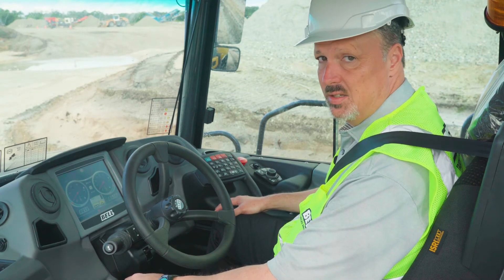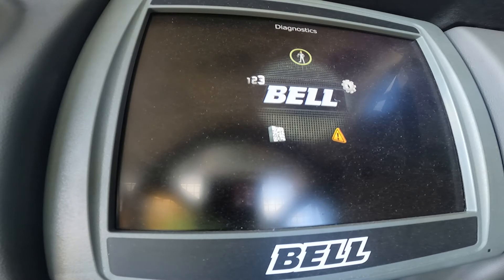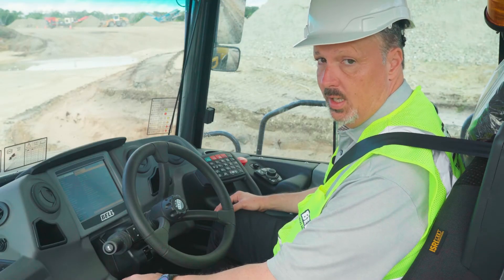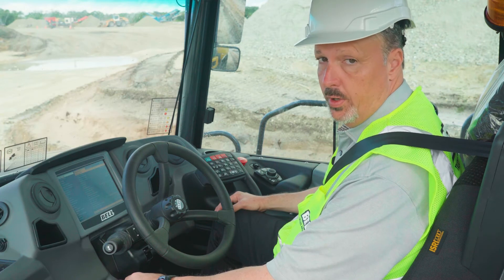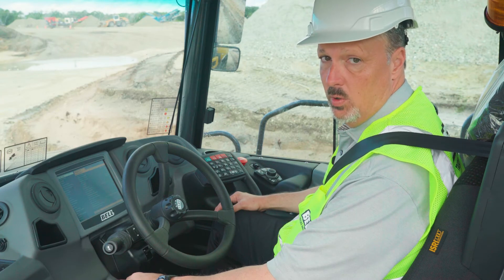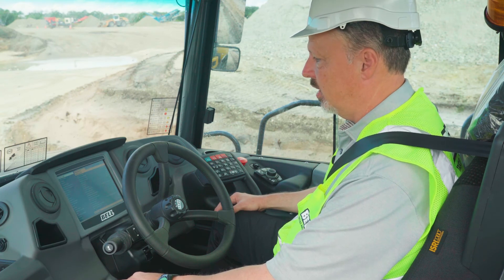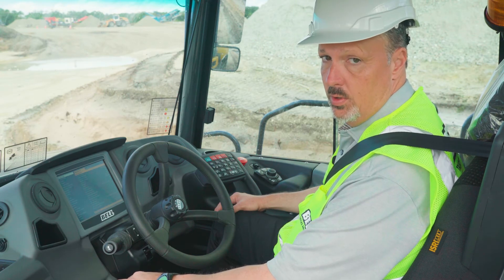To access the diagnostics menu, go to the B drive and select the E button, then select the diagnostics menu. You'll see a screen showing a series of green checks — green checks are positive, meaning your levels are good. If you do have to fill any fluids, do so before you start your shift. It's especially important to monitor the DEF fluid level; if it falls below 14%, a warning symbol and light will appear on screen. These trucks are Stage 5 Tier 4 Final compliant engines and require DEF fluid to achieve those emission standards.